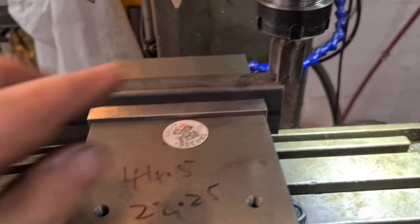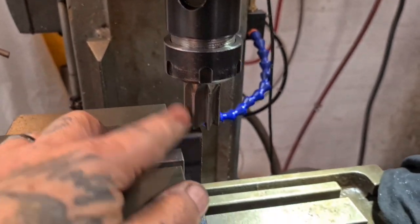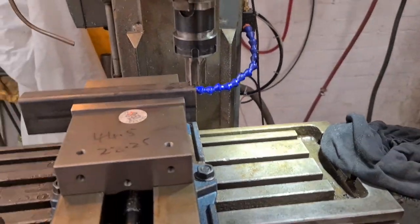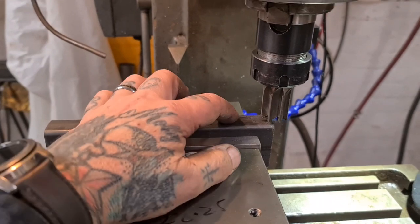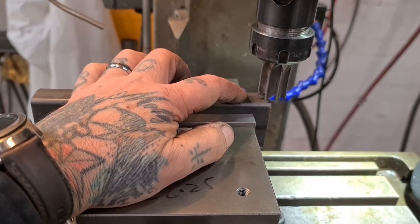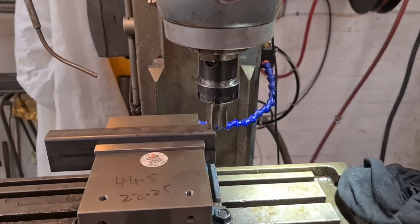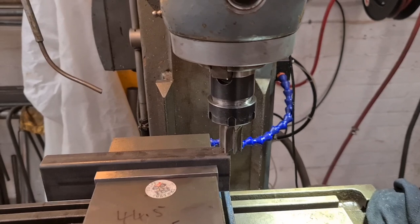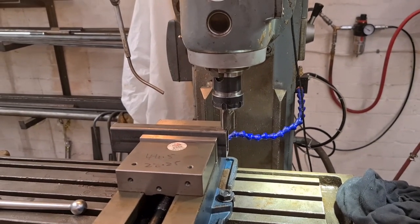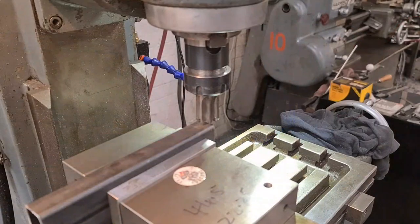Here's a bit of box - I'm just going to profile it out with this one-inch cutter. I've marked three-eighths where I need to do it, then flip it, same again, then the same on that end - four cuts and we'll be ready to tack it to the bench. Then we can run those rear engine mounts and that'll hold everything steady while we work out the tubing and get the tube in place.